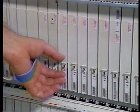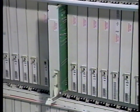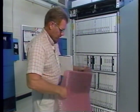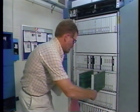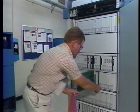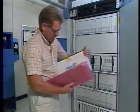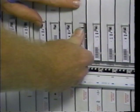Packs in simplex units are easy to change. As soon as the latch is pulled down, power is removed from the pack. Installing a simplex pack is just as simple. Note how the packs are handled — they don't touch any non-grounded surface. The old board is protected before it leaves the machine. Power is restored to the new board as soon as the pack is plugged in.